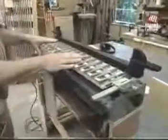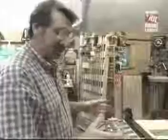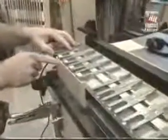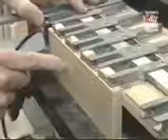Now, I'm going to use a dovetailing machine. And we've used this several times. It's very complicated. It comes with a very thick manual and a video. You have to work with it and learn it. It takes some time. It has a lot of good features. You can adjust the fingers for any dovetail layout that you want. So I've set those and put these fillers in between. I've installed one of the drawer sides with the inside facing out.